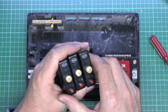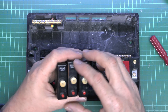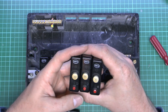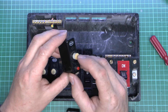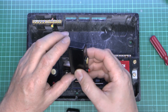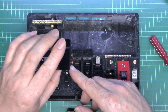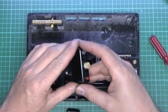There were probably four ratings of these originally - there may well have been a 20 amp. We only have the 5, 15 and 30 here, but a 20 amp certainly was available in the fused version, so you'd expect that to have been available in these as well. The difference between 15 and 20 is fairly small so the 20 would be fairly uncommon. These work the same way as the Wylex ones - you press the button in to connect the circuit, and if it's overloaded or there's a short circuit the button will pop out. You can also release it by pressing the red button at the bottom. Just like the Wylex ones, these have the issue where that button will stick out, so if something in a cupboard brushes against it, it can actually turn off half your circuit.